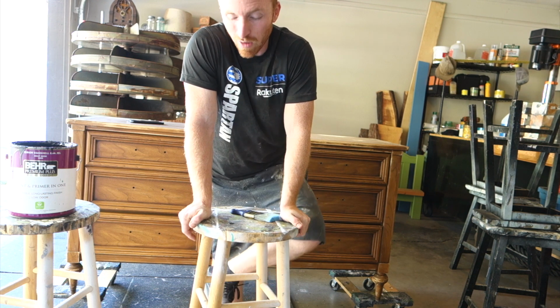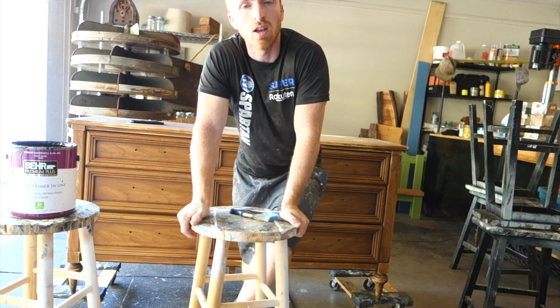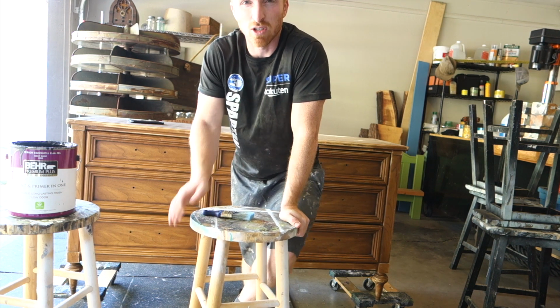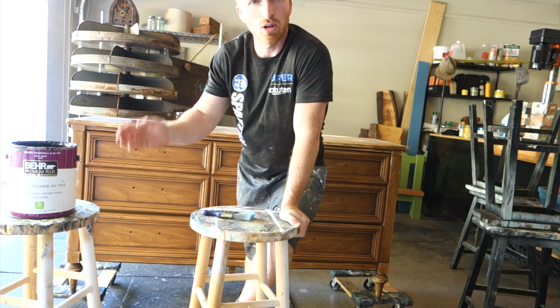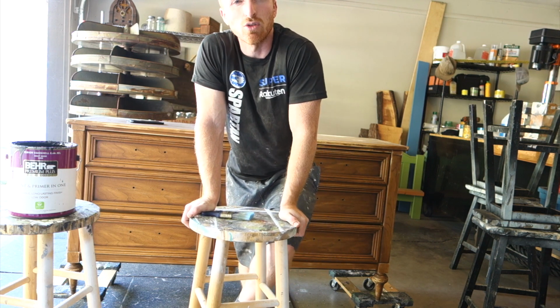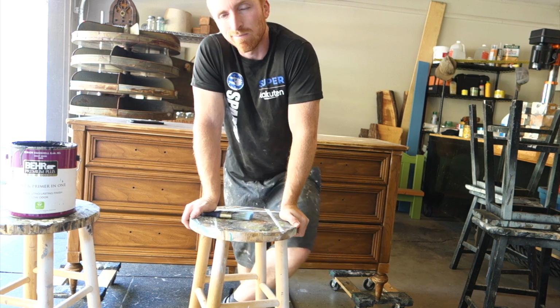Now there's a few things that we have to watch for when we're in Phoenix here, and it's how fast the stuff dries. So if you're going to glob up your brush here, you're going to get a lot of globby marks, and that stuff's going to be hard to spread. So take it a little easy, use a little patience, and just get a little bit on, spread it out, go for it again, over and over again, until you get that desired amount on the drawers and the frame. And then we're going to do 2 coats. So let's get started.